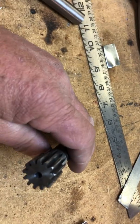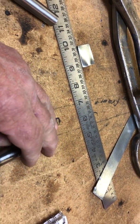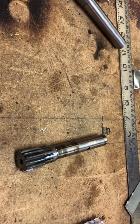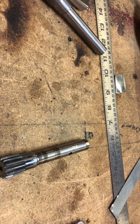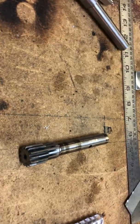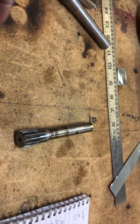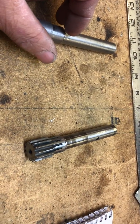Okay, so the other day, I was threading some stuff on my Grizzly lathe, about 6 weeks ago or so. I was threading a breech plug, and it was a metric thread, so I was leaving the carriage engaged in the feed setting and backing out, stopping the lathe at the end of the thread, backing it out, running the lathe in reverse, out past the part, feeding in, engaging it into forward again, and dialing into a new depth and making the cut, just all that fun stuff that you deal with with metric threads on the Grizzly lathe.